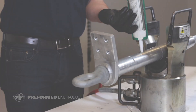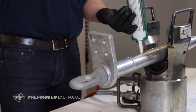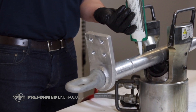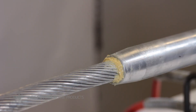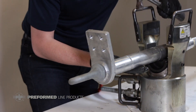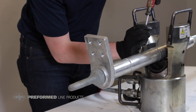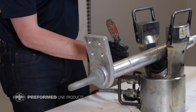Inject appropriate inhibitor compound through the filler hole in the aluminum body. For ACSS conductors, the inhibitor must be rated for temperatures up to 250 degrees Celsius. Cease application when inhibitor seeps out the tapered end of the hardware — it will continue to ooze out the ends as compressions are applied. Seal the filler hole by inserting the stainless steel ball. The plastic bag containing the ball can be used to help position it. Tap the ball into the filler hole using a hammer and remove the plastic bag if used. Peen over the aluminum edges of the filler hole with a hammer and flathead screwdriver to secure the ball into place.